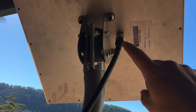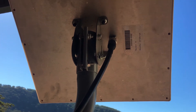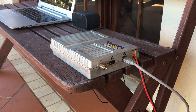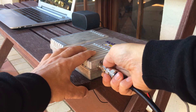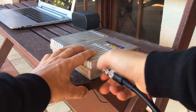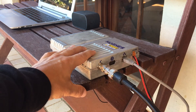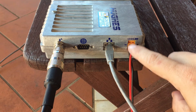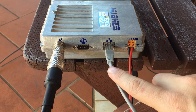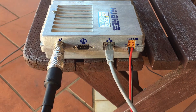Plug in the antenna cable to the antenna, or what they call the outdoor unit, and plug the other side of the antenna connector into the indoor unit — the IDU. Connect 12 or 24 volts to the power terminals and an ethernet cable between the indoor unit and a laptop. We're going to use this to check the signal strength while doing the setup of the antenna.